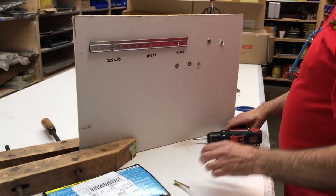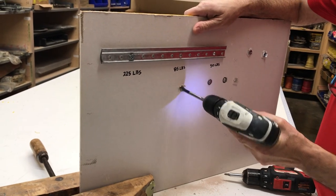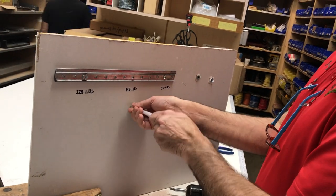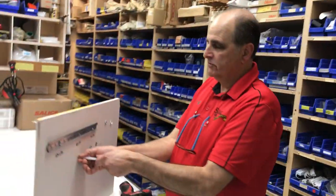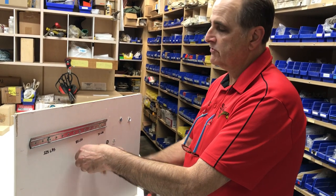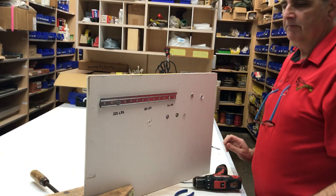Now the big one is this one here — this is very cool. It has the same principle but requires a spade bit and a half-inch hole. You drill the hole, insert this into the hole, grab this and pull it. The trick is that you pull this really tight because you want that thing to seat. If you look at the other side you can see how it spreads out — if you don't do that it's going to cause problems when you put the screw in. I've discovered you just take a pair of needle nose pliers and give it a little tug to make sure it's tight, because if it starts to spin it's going to cause you a lot of problems.